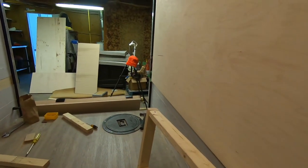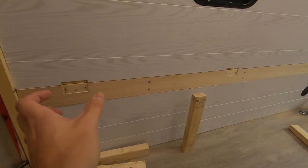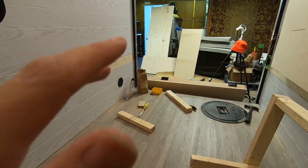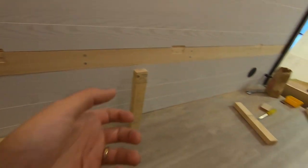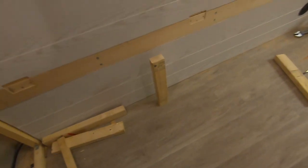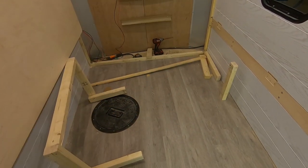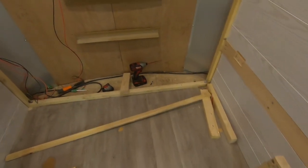So basically what I'm just gonna accept is that the hinges on this bed are gonna be mounted 3/4 inch offset from this one. The gap is the same, and the gap on the other one was the same. I backed off all the screws, allowed some tolerance and movement, and even with that, while trying to pull as much as I can to get them to line up, everything seemed square, but it was misaligned by 1/2 inch or 3/4 inch or something. I really don't know where that's coming from.